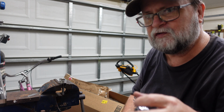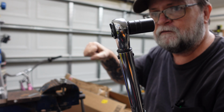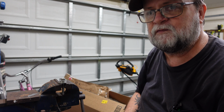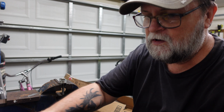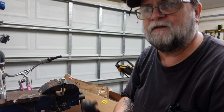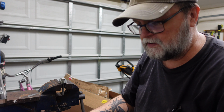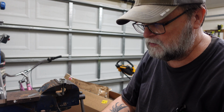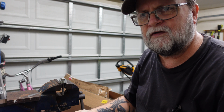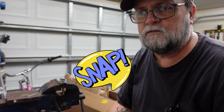Because when I first got these, I wasn't paying attention. I was expecting a good click that you could feel and hear. And guess what? I broke a bolt and then had to spend the time to extract it, right? And we all know how much of a headache that is. So having a good click, if you're going to use a click style, having one that clicks loud enough where you can hear it and feel it is a good thing. That's the kind that you want. You don't want to be wondering, did it click or not? Darn, this bolt feels like it's getting awful tight. I don't know if I should go anymore, and then snap, darn bolt broke.